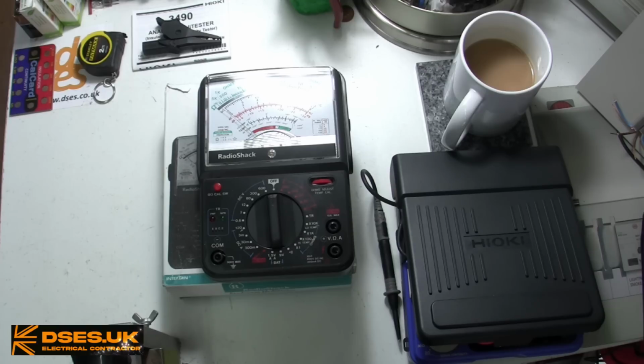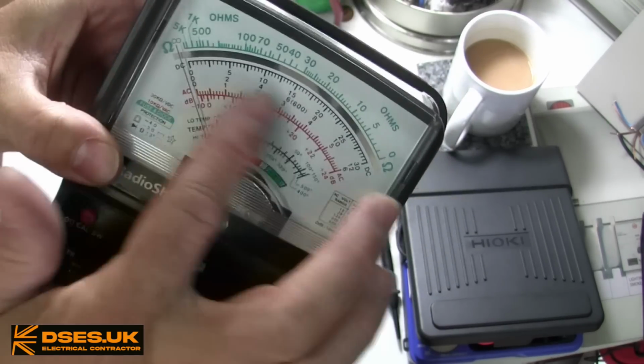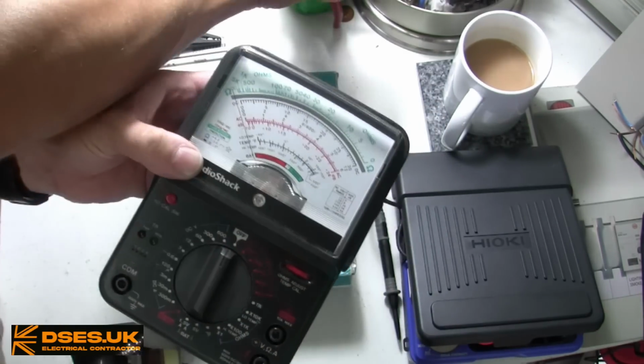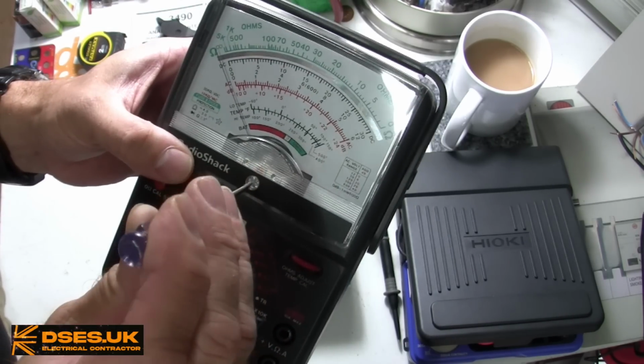Back then, analog meters were more prevalent and cheaper than their digital counterparts, although I did covet digital equipment as it looked smarter and more high-tech futuristic. Sadly, my pocket money of the day wouldn't extend to such toys. Nonetheless, this is a fine and well-featured instrument, and I present it here because I wanted to show you its mirrored display. To calibrate the thing, you would look at it dead on so that the needle and its reflection were one when on the 0 mark, ensuring you could make an adjustment to 0 with some accuracy.